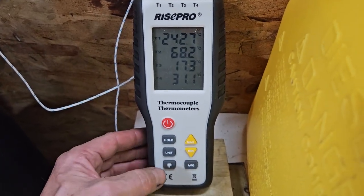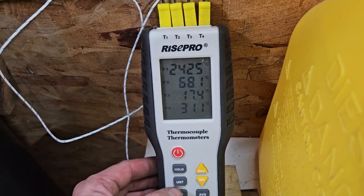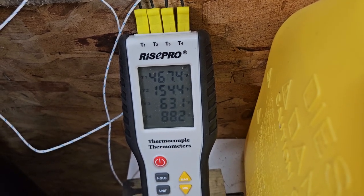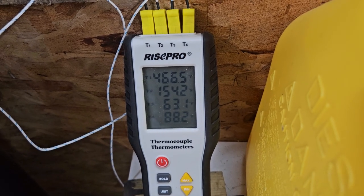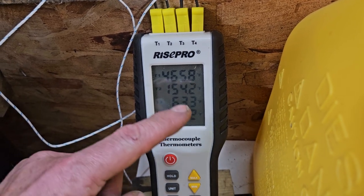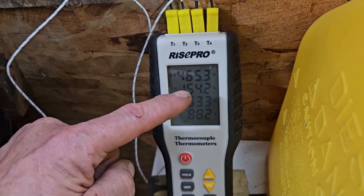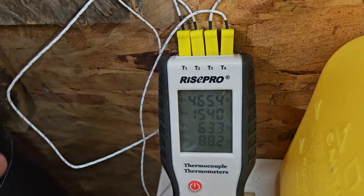For anybody who's a Fahrenheit person, I'll give you a switchover to Fahrenheit now — you can freeze-frame it and extrapolate any numbers you need. So we're getting over 300 degrees Fahrenheit temperature drop through the heat exchanger on the exhaust gases, and about 25 degrees Fahrenheit temperature increase from ambient to exhaust at floor level.